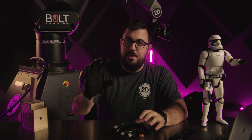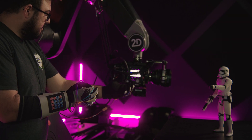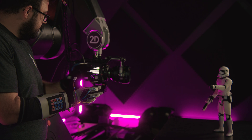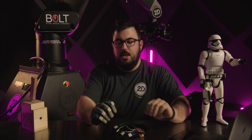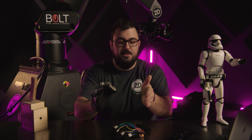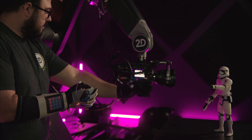If I want to actually control the robot live, I'll need to connect my thumb and one of my fingers on my right hand. Then, moving my left hand in space relays a position for the robot. Without fingers on my right hand touching, nothing will happen — that's a bit of a safety feature. In order to keep things intuitive, the orientation of my hand doesn't actually matter, unless I put all four fingers together, in which case orientation makes a difference and I can change the angle of the robot. If I simply move my hand, the orientation doesn't matter, and that makes it a lot more intuitive to push and pull the camera around.